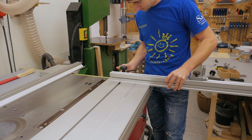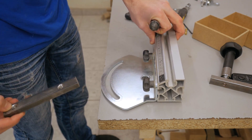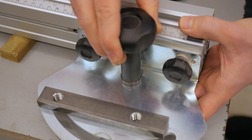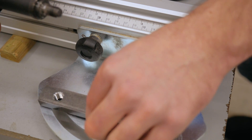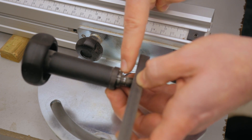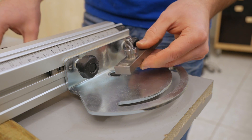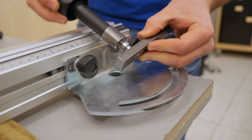There's another part they improved on, which is this knob here. The original knob has the whole fence pivoting on a precise fit around part of the knob, with pretty much no play. But the problem is that it's attached to the threads, and when you lock the fence down to the sliding table with the bar, you lose the position of the fit because of the threads. What they've done to improve on that is take the pivot point with the threads and glue it into the bar, so the new knob just screws onto there. Pretty simple actually.